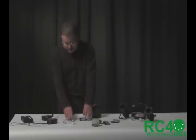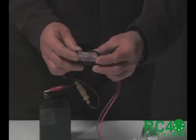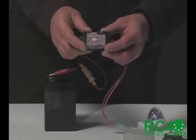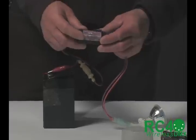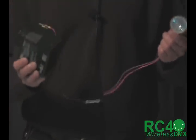Very, very easy to work with — conceptually, it's quick to grasp. Here's our simple little two-channel receiver dimmer, so there are two channels of dimming. Each dimmer can be assigned to its own DMX channel, and I'm showing it here in the simplest configuration: a battery for power, one channel connected to an MR16.